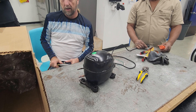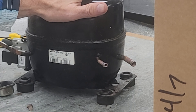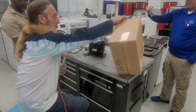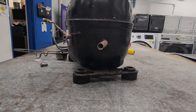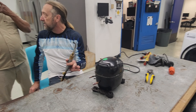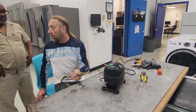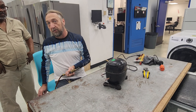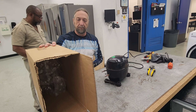I saw it — it already blew it out! What happened is I ran the compressor for about three seconds before heating it, so it sucked air in and put pressure on the high-side chamber, and that pressure already blew it out. I'm going to heat it up for another second — go ahead and look inside that pipe — we blew out that restriction. I made him take the compressor out of the refrigerator first; it's just a lot easier to manage. Now I'm going to come back with a screw and show how we use it to pull out any extra solder.